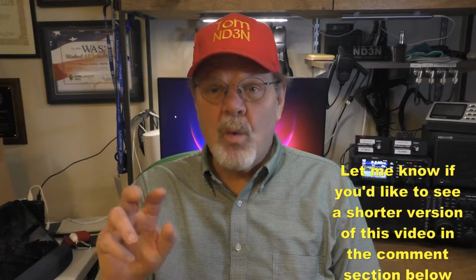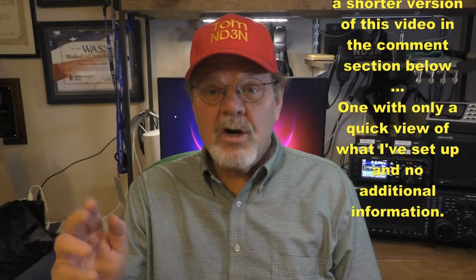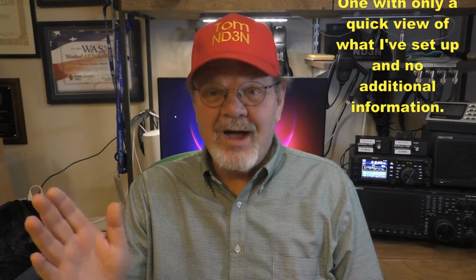Now, I could have made this a really quick video by just showing you how I set mine, but like I will say, your mileage may vary. So not only do I show you the settings across the board, I tell you why you set it that way, why I set it that way, and you are certainly free to go off and do your own thing and adjust. For example, I have my bandpass for a CW signal set at 100 Hertz, 50 up and 50 down. You might want a wider or more narrow, and I'll show you how to set all that up for yourself.